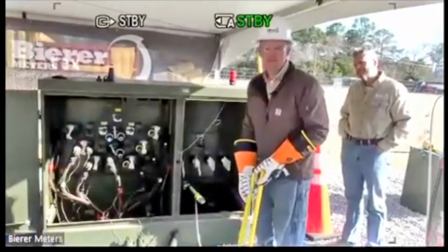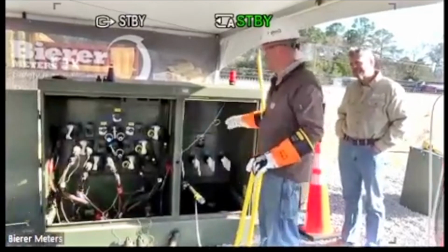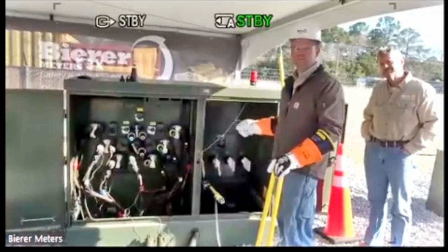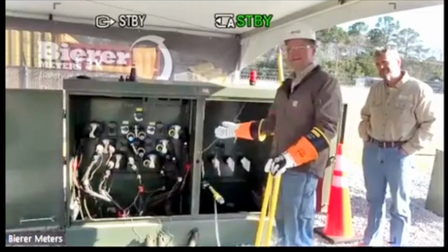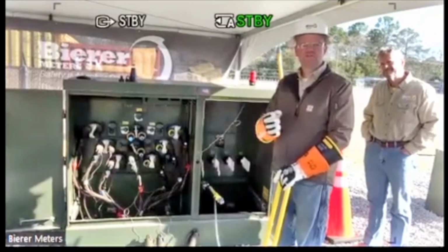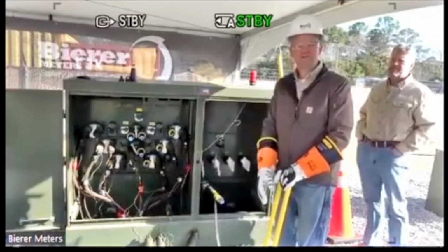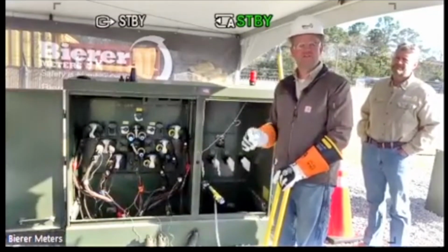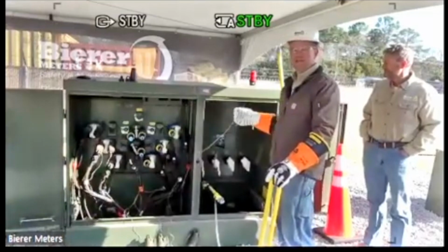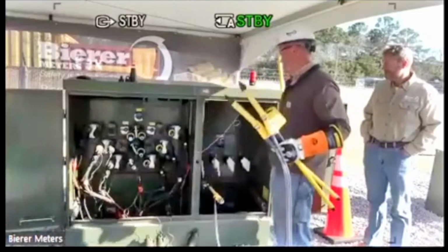All right. So what I would recommend, if you ever utilize this tool versus the tool that you're using now, is that you connect the tool you're using now to this same scenario. And if that tool said counterclockwise, then from that point forward, if your phases went from right to left using this tool, that represents counterclockwise. So you would have to associate it with the tool you're using now, because some of those manufacturers may differ a little bit as far as clockwise, counterclockwise. You would just have to compare this to the tool you're using now to get that designation. But this is telling you the sequence left to right, right to left. All right, so that's on secondaries.